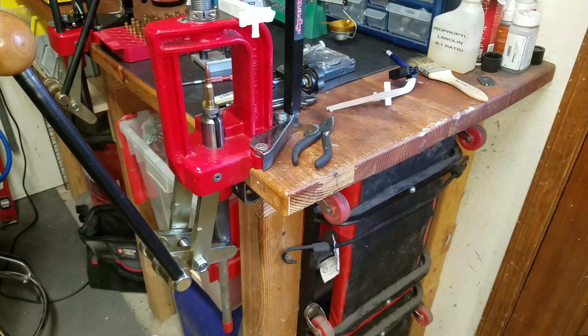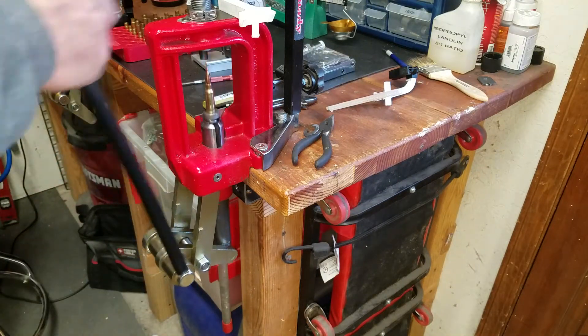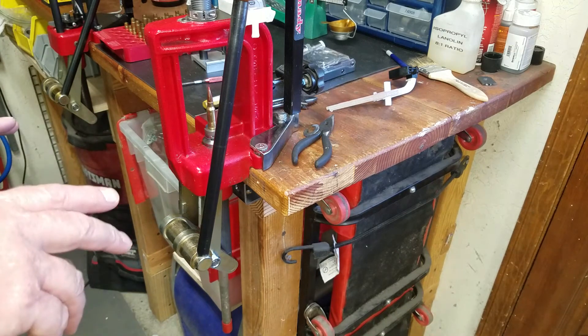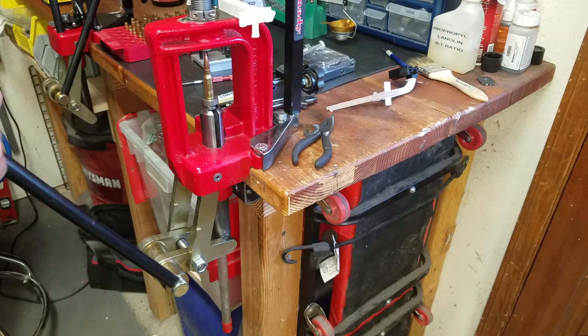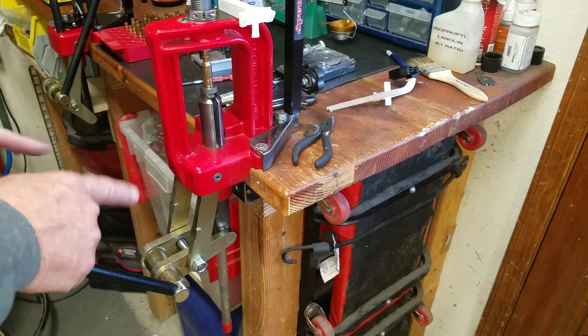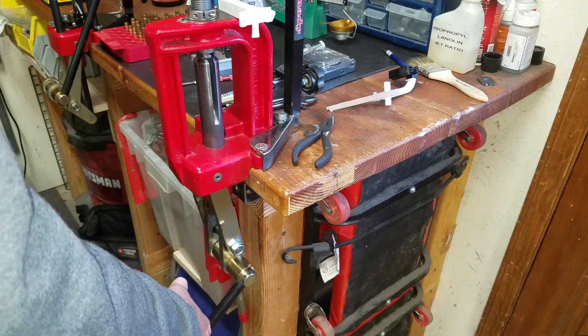If you're shoving on it, I could actually measure up to ten thousandths of movement at the top — not helpful. To prove that, I separated the links and put some bushings in there so that I couldn't hit the stops, converting the press to a cam-over style press, which is actually an interesting idea. After doing that, without putting a side load or radial load on the ram by hitting the stops, I was much more concentric in my ammunition. For a while I thought I'd just leave it like that or even cut the nubs off and permanently turn it into a cam-over press.